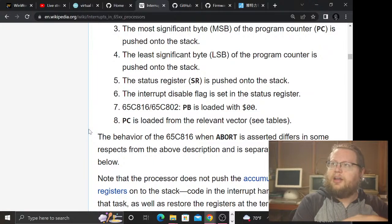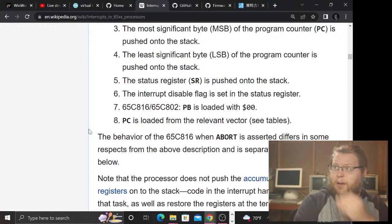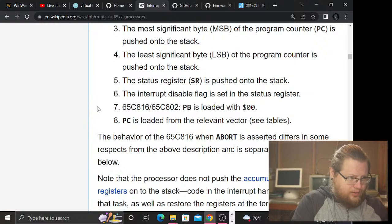The Gotek is set up. It's working now. Everything is fine. We're good. We just did some tests. My bootable and non-bootable versions of the boot sector are working fine. So I'm going to implement some BIOS calls, and then we can write some boot sector code that uses them. How about that?